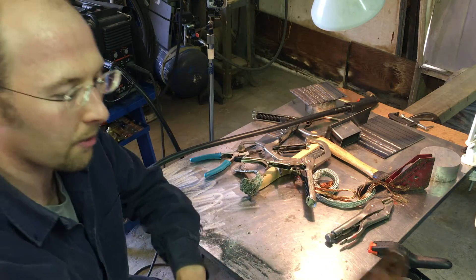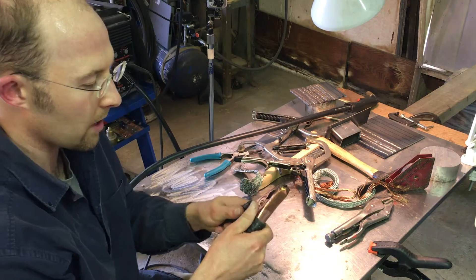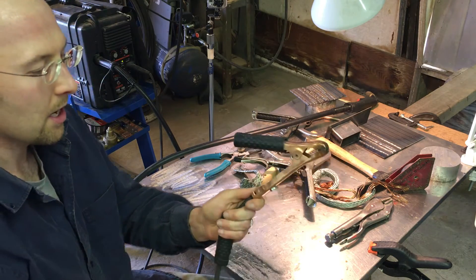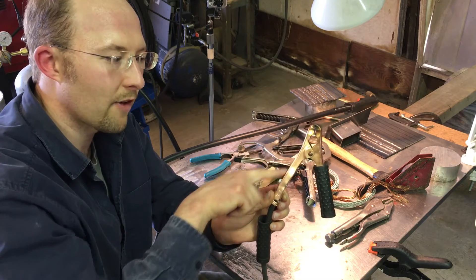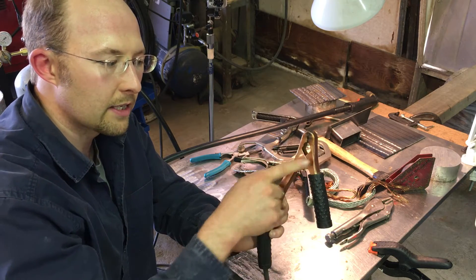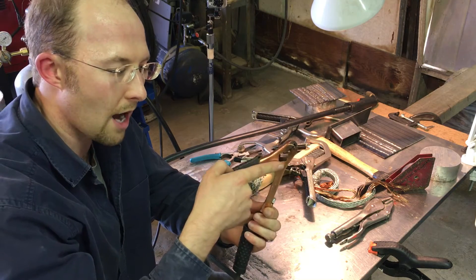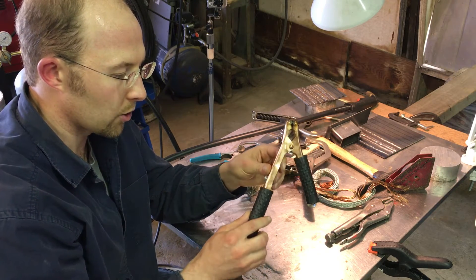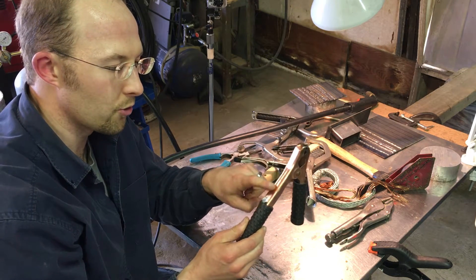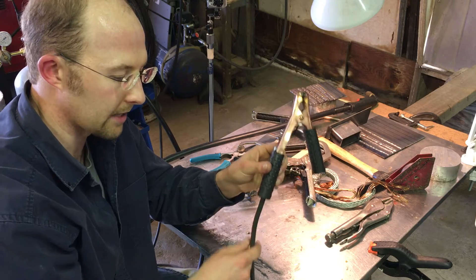Or if you're stuck with one of these little cheapies, one thing to note is that often the wire is bolted to only one half of the clamp, and the other half depends on electricity flowing through the rivet, which may or may not flow consistently.